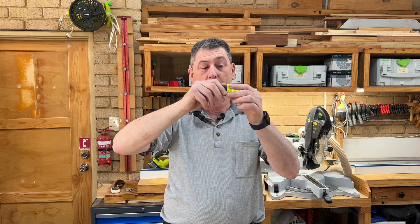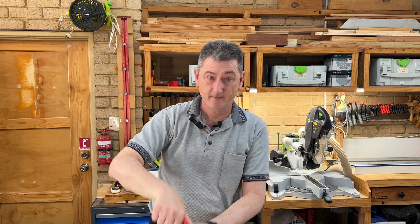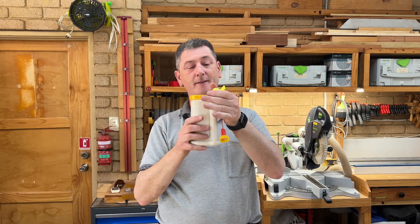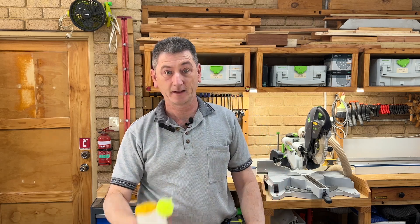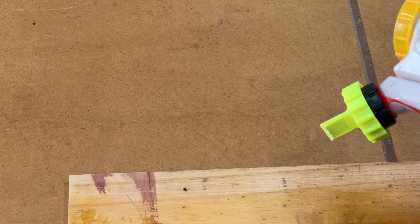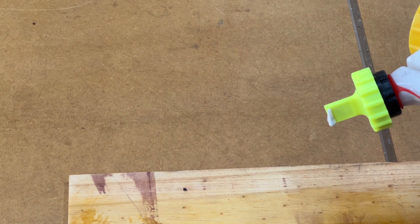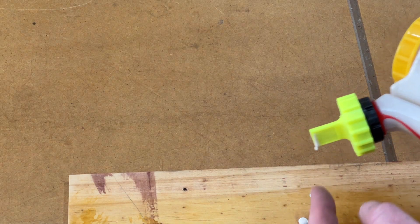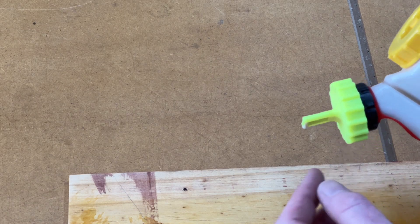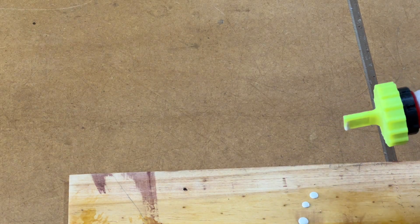It just screws in there quite easily — perfect fit. So just imagine you've made yourself a little domino hole — let's give this a little squeeze. You can see the glue coming out the tip there, so it gets the glue down the bottom of your mortise, but on the sides rather than the very bottom. The reason that's good is as you drag this up it's going to glue the insides of your mortise rather than just leaving a big blob of glue at the bottom.